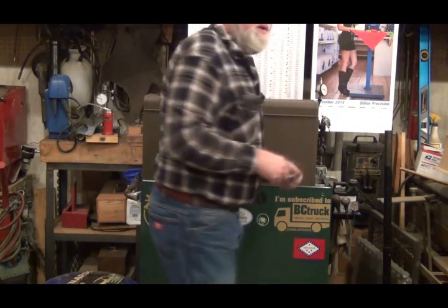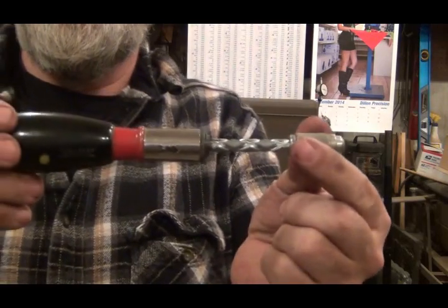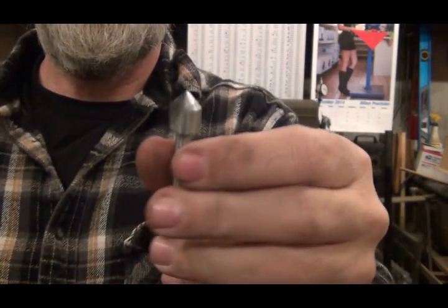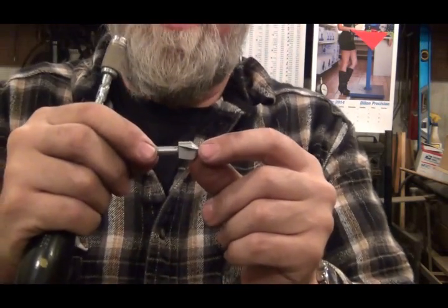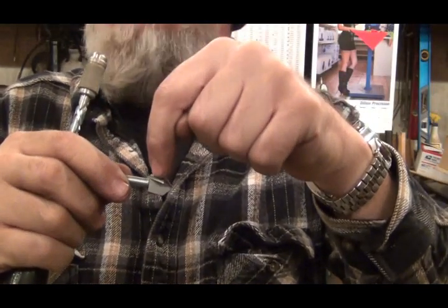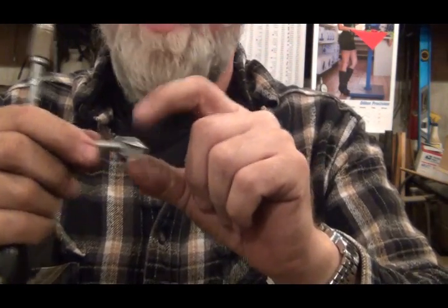My morning project is copying off of Tom Lipton, who copied off of someone else. I've got one of these nice little Yankee screwdrivers, and what they did was put one of these chamfer reamer tools in it so you can quickly chamfer a hole you just drilled and take the burrs off. Unfortunately, I don't have any chamfer tools that fit that size — it's pretty small. So the project is: I've got a piece of one-inch material in my mill. I've already cut it off, and I'm going to drill a hole in the end of it on the lathe.